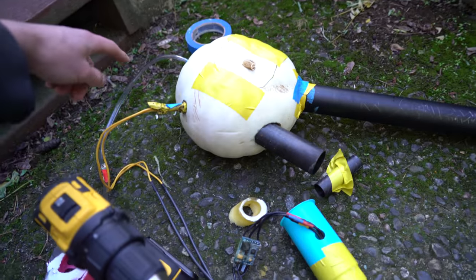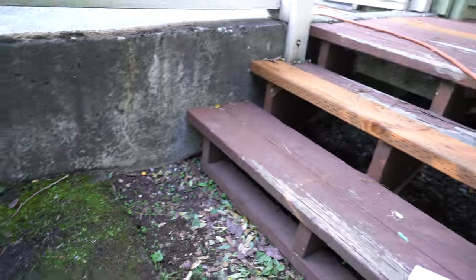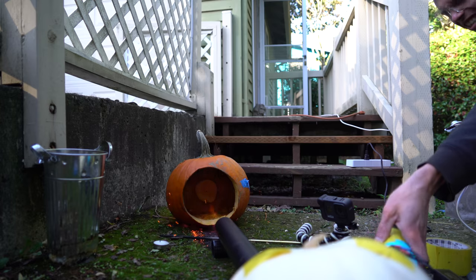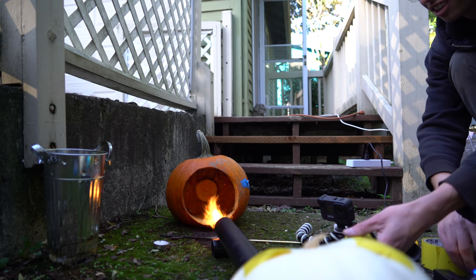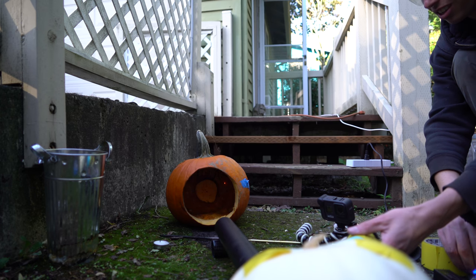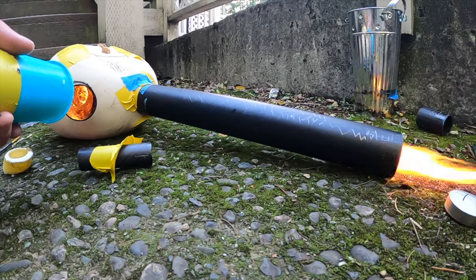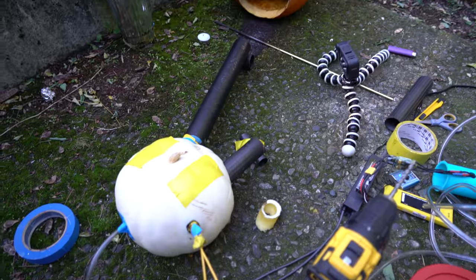That was working better with the shorter fuel tube lodged right in the front of the air intake, so it was probably mixing the fuel and air better. Got the 40mm air intake now. We're getting so much resonance, but still right when I take the EDF away it just stops — so it's kind of an electric hybrid pulse jet, I'll call it that.